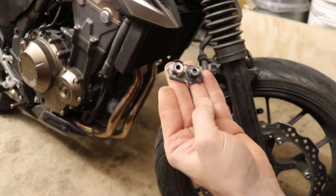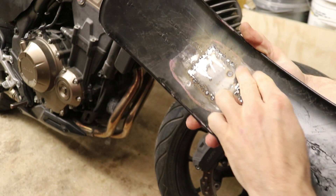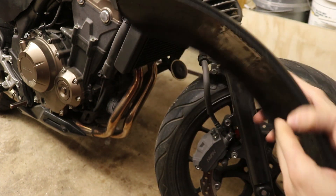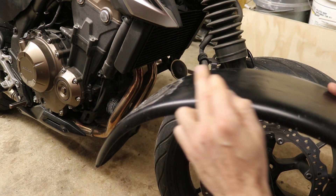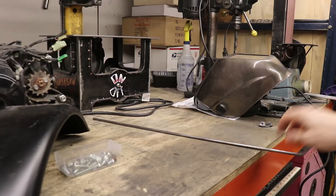As you've already noticed, I've already cut out the previous connection point, welded in a little reinforcement here, and another reinforcement on the bottom, so this thing is sort of back to flat up here and we've got extra metal on the bottom. Now from here I want to make the little quarter-inch rod that will run the radius of this fender going down and have another connection point down here.